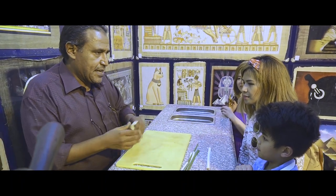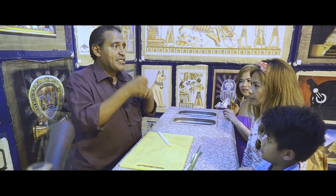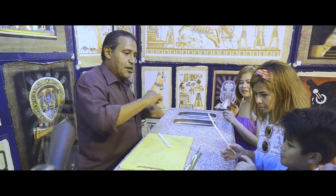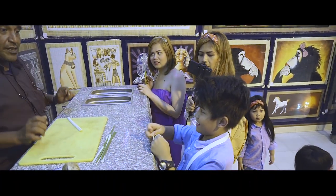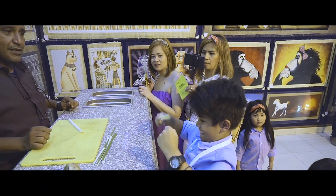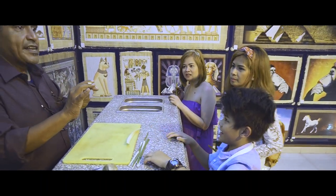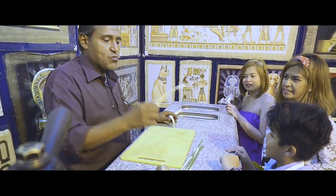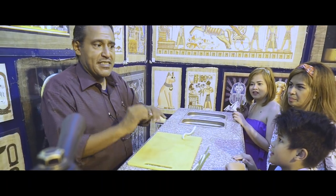What we do actually is hammering and layering this piece here, so you can see that it becomes flexible and strong. Jabir, can you roll this on your arm? Yes, exactly — rolled. Is it strong? Strong. The other one that we haven't hammered or rolled is not flexible. That's because the hammered and rolled piece is flattened, with all the fibers laid next to each other.